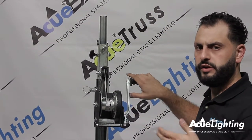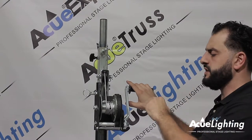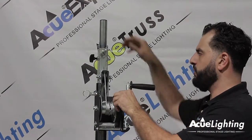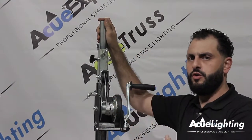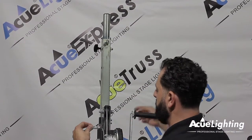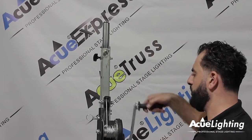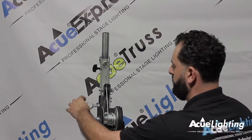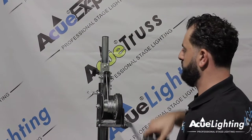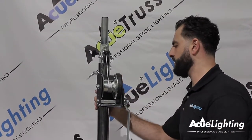You can see the clicking. What the clicking is is an actual lock that engages every single time you crank it — it's going to sit in its place. So once you let go and there's weight coming down on it, it's going to lock it into place. To bring it back down, release the side pin, pull out the side pin, and you can go ahead and bring it all the way down. It locks into place, then go ahead and tighten up the side lock as well.